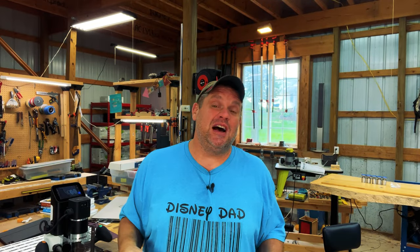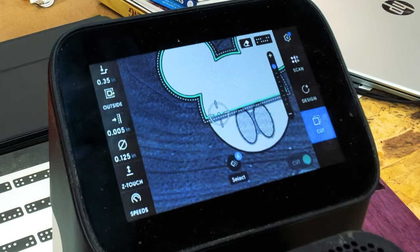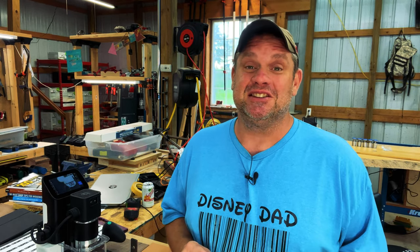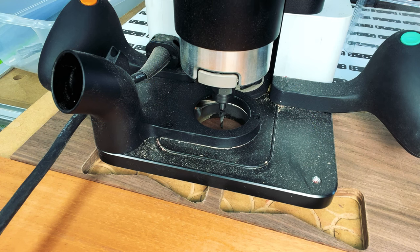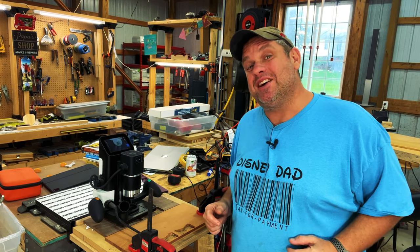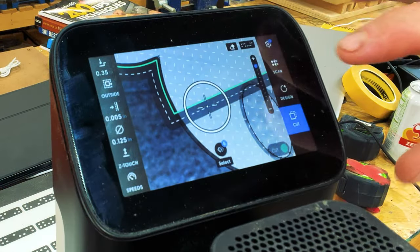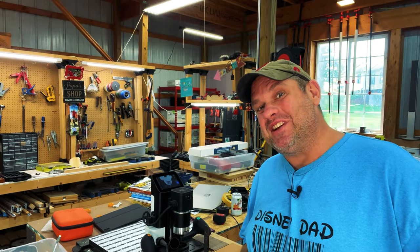Now that I've placed the SVG file I'm going to start cutting around the exterior of that drawing. I'm going to make multiple passes, each about a tenth of an inch deeper. I'm also going to be offsetting each one of these cuts at five one-thousandths of an inch, then on my last cut I'll do it right on that line. In this case I'm going to be cutting out the top of those ears. But before we do any cutting I need to do a Z-touch, which lets the machine know where your drill bit is relative to your material. Now that we have all of our alignment set it's time to trace out those ears — you'll see ants marching in line, and this is what we're going to follow to make our cuts.